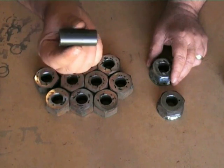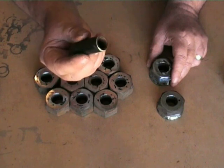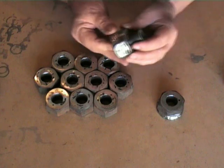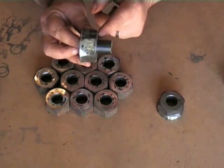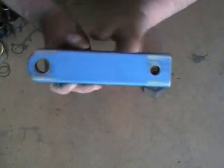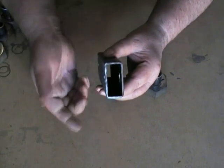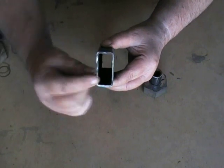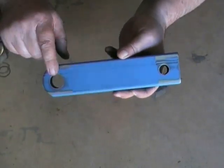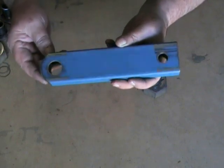What we have here are bushings — 50mm long by 21.6mm, or just a fraction under 7/8 of an inch — the same bushings as we use on the road wheels. We place those in so that they protrude 25mm from the inside face of the boss. The actual suspension arm is made from rectangular steel tubing, 50mm by 25mm (2 inches by 1 inch), with a wall thickness of 2.5mm. It is quite strong, sturdy and easy to work with. We have a 7/8 inch hole drilled at one end and a 5/8 inch hole drilled at the other. Check the drawings for exact dimensions and layout.